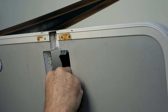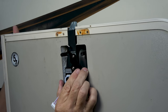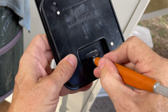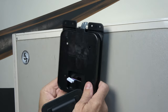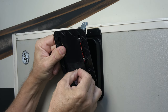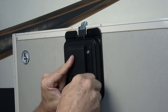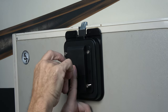From the outside, I carefully feed the rest of the lock into the hole from where the old lock used to be and maneuver it into place. Before I could position the cover plate, I had to cut out a small punch-out where the wire from the lock mechanism is going to go through to the battery compartment — I just use an exacto blade to cut it out. Then I put the wire through the hole, position the cover plate, plug in the wire to the battery compartment, flip it around, and position it over the cover plate to screw all three components together.